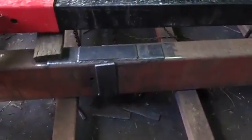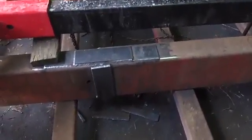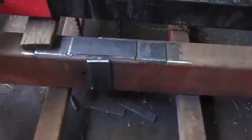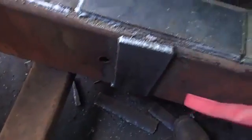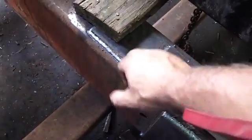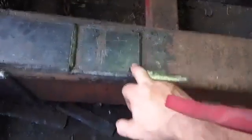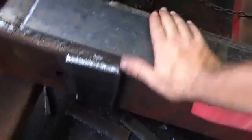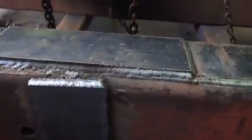These are the patches. As you probably see, Cody welded the majority of one side, and I welded the other. So this is Cody's side. He did the majority here and did okay. So what I did was I took 1/4 inch flat steel. I made a 2-foot patch across the top there, and then a 1 foot right over the seam. Welded it all together. I'm sure someone's going to tell me to drill a hole and weld in the middle, but I'm not going to do that.